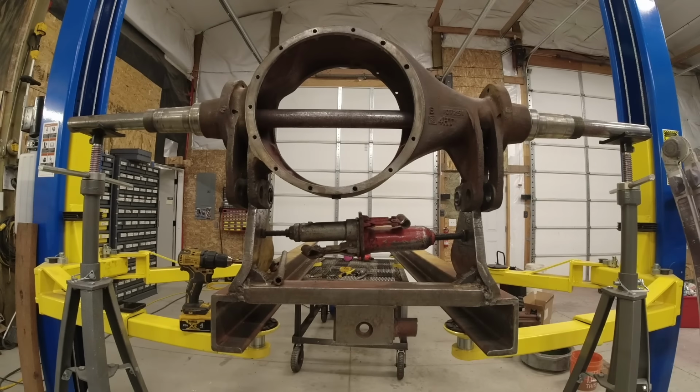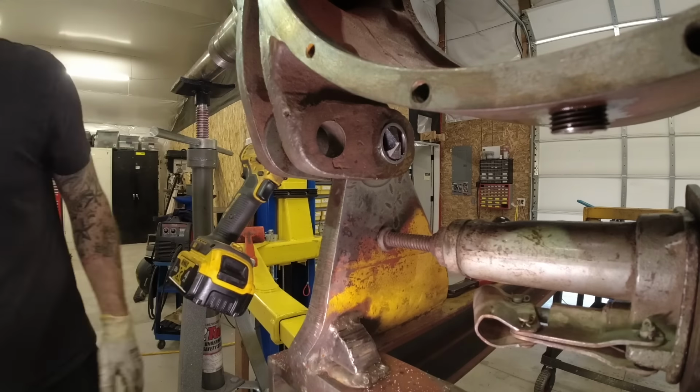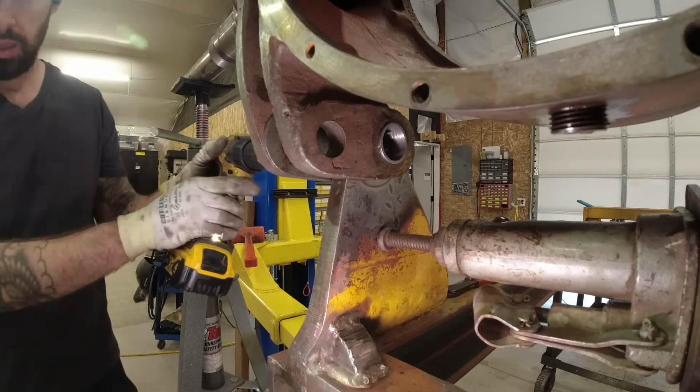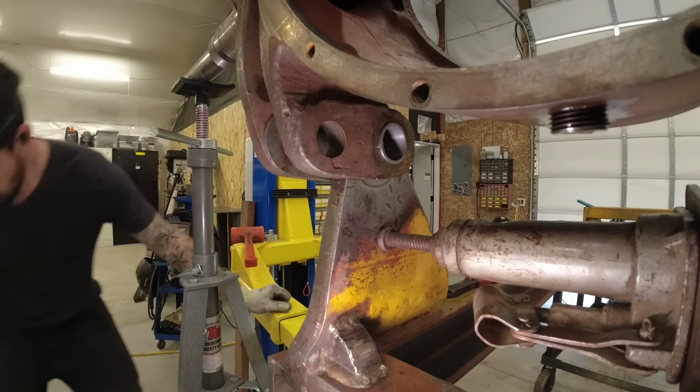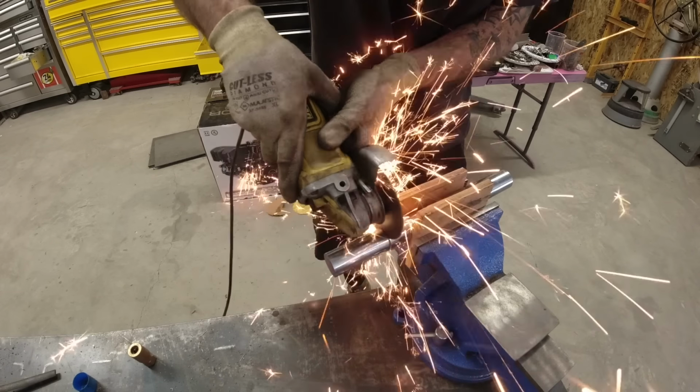Now the center holes on the mast are still unfinished after the welding, so my plan was to send a 1¼-inch drill bit through using the bushings as a guide and then send a wheel cylinder hone through to get everything nice and smooth and then the center pin.